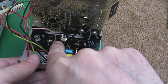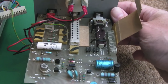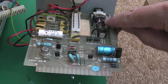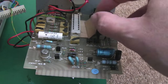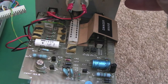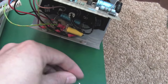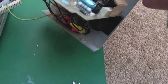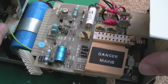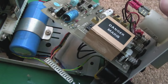I've got the replacement cap in, the replacement neon fitted, and connected it to the two switch positions underneath where the two black wires go. I tested continuity when it's on — these two are joined up. I can see there's a strand of solder there — I think that's where it was originally soldered, and the cable came across the top side. I'll reattach that more carefully later, and put something underneath to isolate those wires so they don't contact anything on the board.